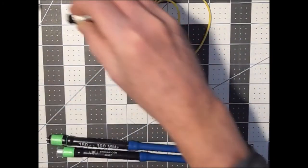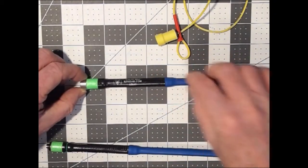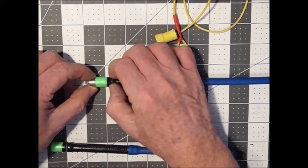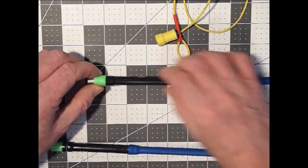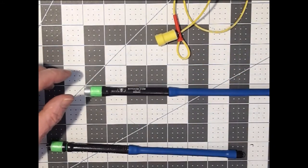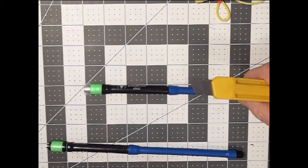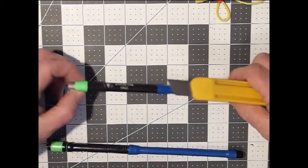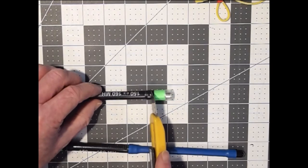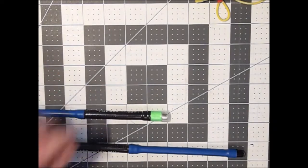However, that becomes precluded with our proprietary design where the tubing goes from here right down to the bottom. You can't see it, but right about here is where that base connection is, and now it's sealed in. If you already own one of these and then you upgrade later on to a counterpoise adapter, or you need to get a different style base, you can actually take an X-Acto knife and circumcise right there, just cutting through the tubing, and then you can unscrew that.